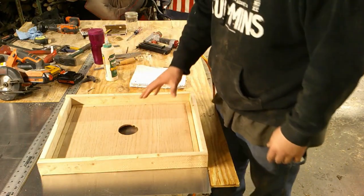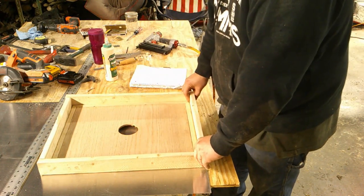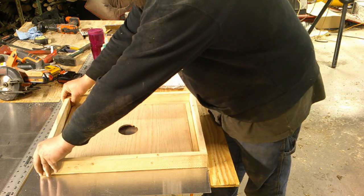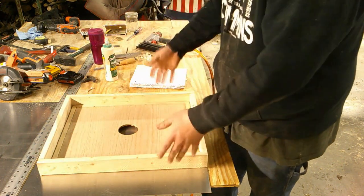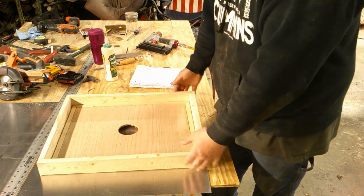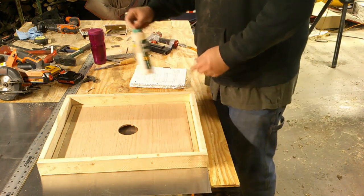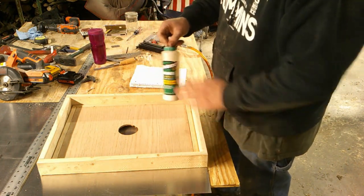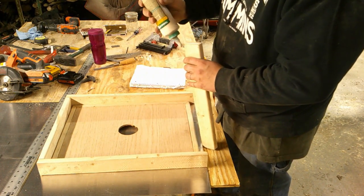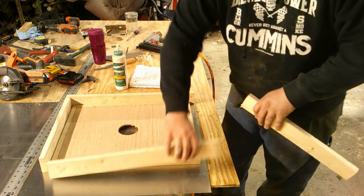As you can see, I've got one of the inner covers we previously made. The way I cut these boards, they will fit perfectly around that inner cover — there's a little bit of a gap, but not a whole lot. You want to be able to go up and over it. There will be some swelling of the wood, so if you make it too tight you won't be able to get the thing off. I do have a little bit of gap all the way around. I'm going to go ahead and use my Titebond 3, do a little dab and streak. I'm going to use my two inch brad nails.